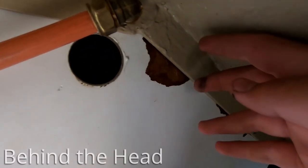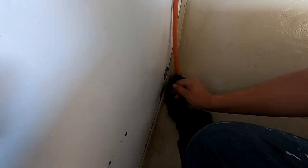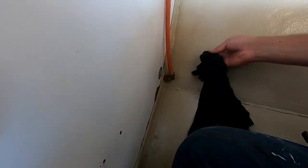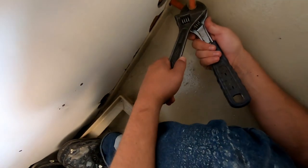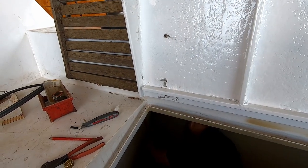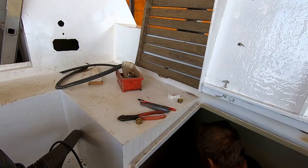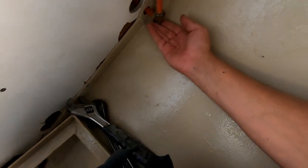It's definitely leaking there — you can see there's a drop right there. I need to make sure if it's this one or this one that's leaking. I think I made it worse. Tommy's put a new elbow in there with a new ferrule and a new nut. The proof of the pudding is in the eating — so we're going to put the water on. Let's see if it works. It's completely dry. You're lucky Tommy!